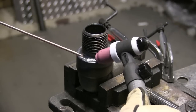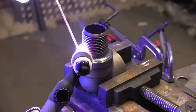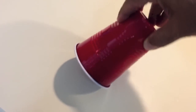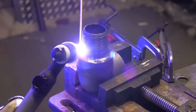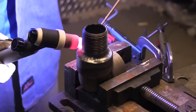Really, it wouldn't matter a whole lot. The second pass is a little bit slower and wider weave. Instead of a little quick, narrow wiggle, it's a much wider weave — much like walking a 55-gallon drum across the shop floor. And the best way I can demonstrate that is with the red solo cup here on a kitchen counter. Just like rolling a barrel across the floor — you tilt it, then roll it a little bit on the rim and go back and forth. That's essentially what walking the cup is. To translate that motion from your wrist to the cup where it's resting on the weld: the first pass wiggles, the second pass you're resting on the weld and then you're walking. It's a slight difference that if you don't pay attention, you may not notice.